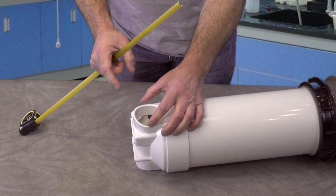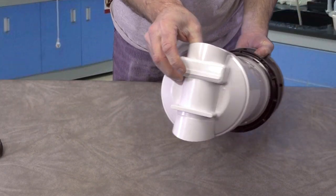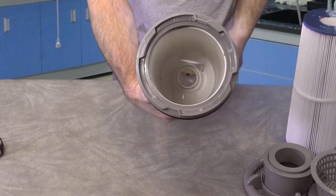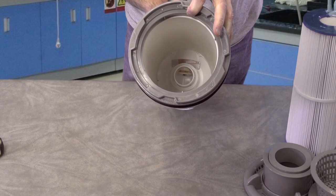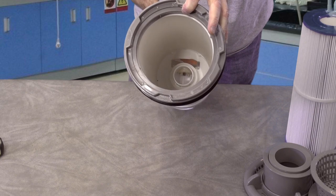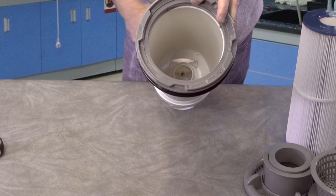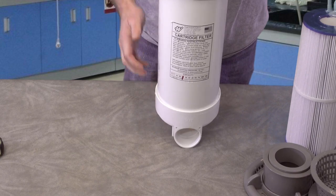If you measure the outside of the pipe, you can convert that on the website, and then you can see what the bottom looks like. And then you see in here, if we pull the filter out and look down in there, there's a valve that actually moves. You see that? That's going to be the push side. The point of this is as the filter stops up, this will open more. The water will come through here first. As the filter stops up, this will open more and basically bypass the filter to go through the rest of the system. You will also see systems where this side of it is simply plugged off, where all the water movement has to go through the filter.